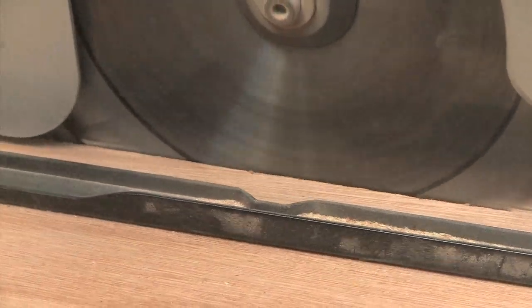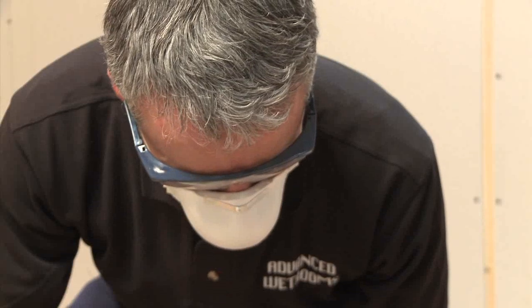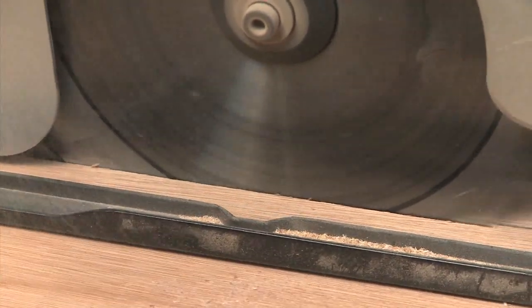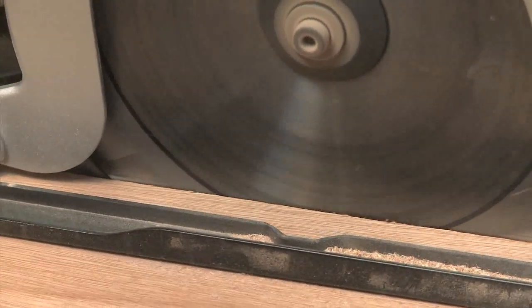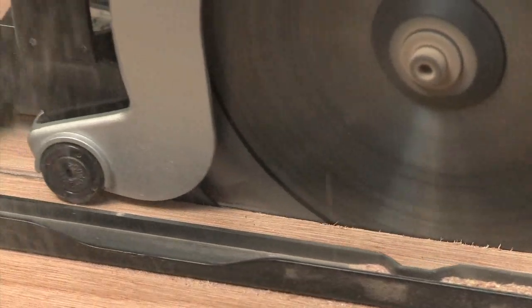Adjust your circular saw to the depth of your current flooring to ensure that you do not damage the joists. Carefully cut out the marked shower area and remove the existing floor, being careful not to cut or damage any existing pipework, cables or services.